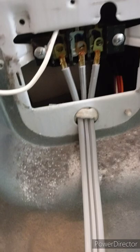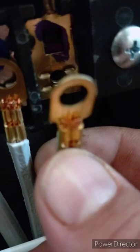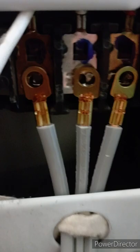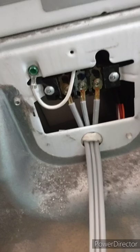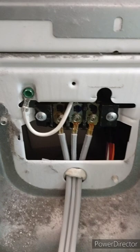Since my old one was a four-prong, I'm changing this plug-in from a four-prong to a three-prong since that's what I bought. The wires aren't color-coded, so pay attention to the direction — it goes straight in here in order. Make sure you run it through this hole before you hook it up to the dryer because there's a panel that goes over it. You can leave the panel off if you don't have one, but I wouldn't suggest it.